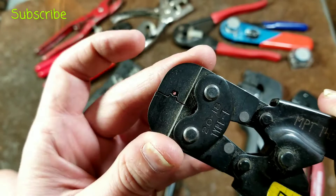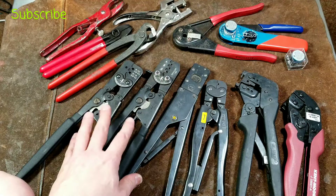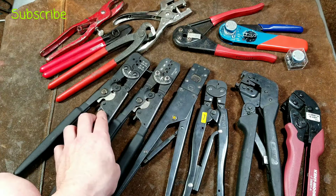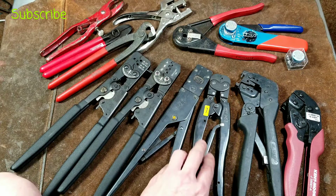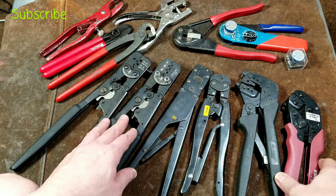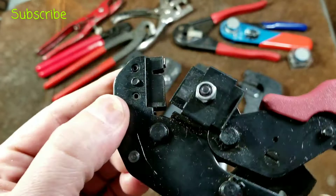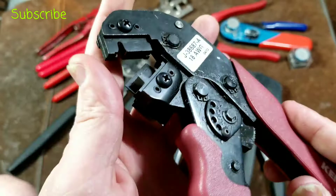The purpose of a one-die crimper is obviously something smaller, lighter weight, and easier to use. It's nice to have multi-die ones because they give you a variety of sizes, but it makes for a bigger tool. Single-size ones are more compact — if you're doing a lot of crimping and it's usually one specific wire size, you'd have this. If you're doing more service and repair, you'll have crimpers where you can work on a different variety of wire sizes. We have some really compact modern-style ones with adjustable cam at 45 degrees, and these are indeed 18-gauge non-insulated terminal crimpers — you just have that distinctive die.